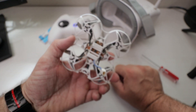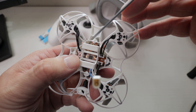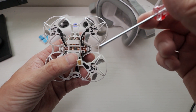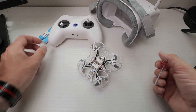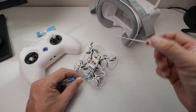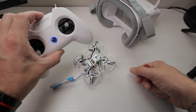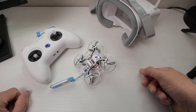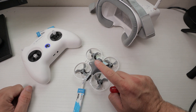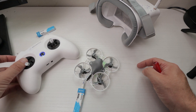Now this is where it gets a little tricky — having a friend might make it a little bit easier. On the bottom of the drone there are two little buttons: a bind button on this side and another button which we don't need. The idea is you want to hold the bind button down as you plug the battery in. We're going to ease the battery in here without really plugging it in — just barely stick the battery in, hold the bind button down, plug the battery in fully. Flip the transmitter over, click the bind button. You'll see it start to flash, and then the fast flashing on the drone — that means it's bound. Unplug it, plug it back in, flip it over, let it initialize. And then you can actually test it by just flipping your arm switch right here, and then right back off. So that bound.